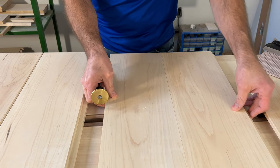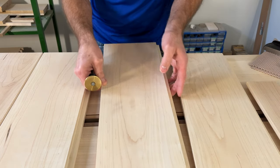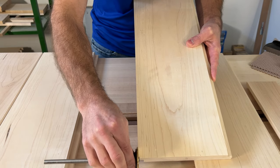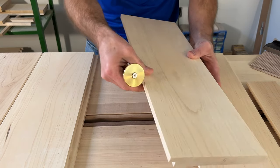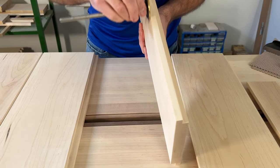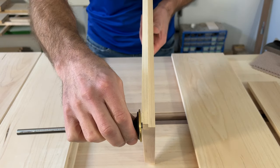The first thing you're going to do is give yourself some guide marks to work to. I've set my marking gauge at a sixteenth of an inch, so we're just going to go up the side here at a sixteenth of an inch. Then I'm going to go along the other edge as well, because we need to make sure that we make that chamfer at 45 degrees — equally spaced from each surface.